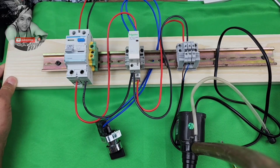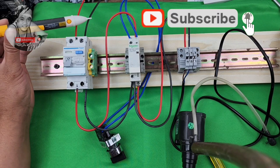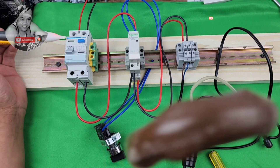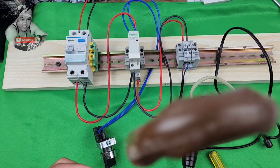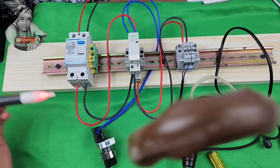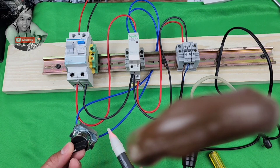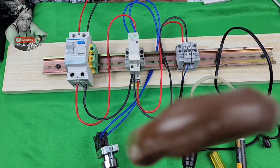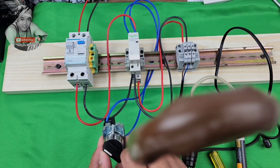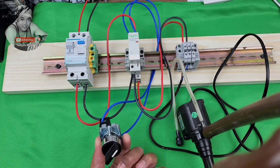So guys, we have the connected power already. Let's check — we have 220V power already. The red one is line, then we will energize our ELCB. First, ELCB energize — breaker is energized. So now we have power here until the contactor and first wire of your selector switch. When we switch on this selector switch, we have the power for the pumps — pumps get energized already. Switch off, no power.